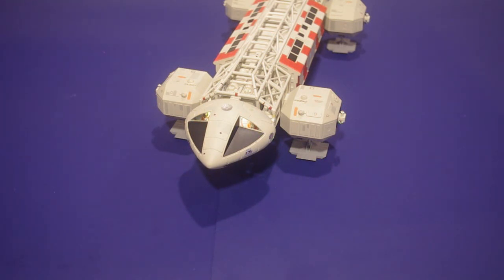CR123A battery, which is a 3-volt battery. You can use it in some garage door openers. Basically any dedicated battery place should have it. I went to Interstate Batteries. There was an office in town I was able to visit. The battery only cost me about $8. And the reason why I use that is because voltage-wise and milliamp-wise, it was actually equivalent to 2 AAA batteries, yet it was put in a really nice compact sized casing.